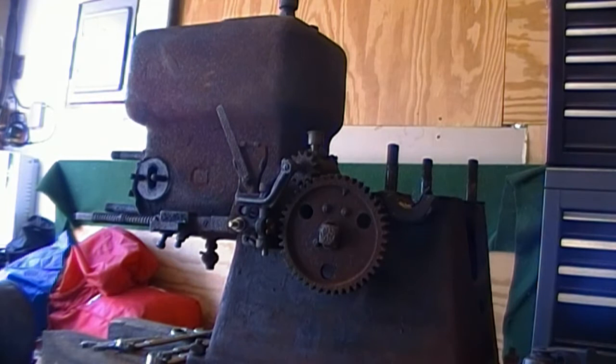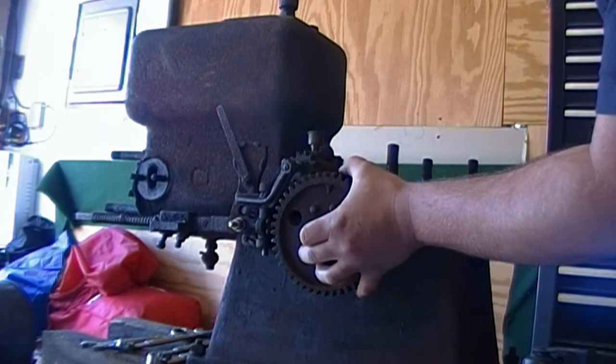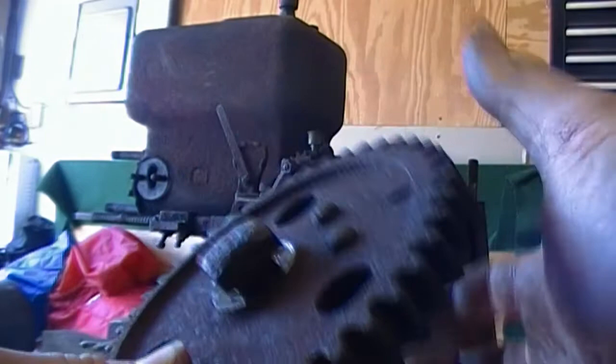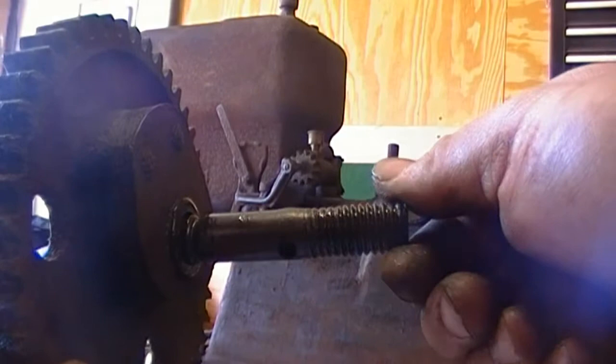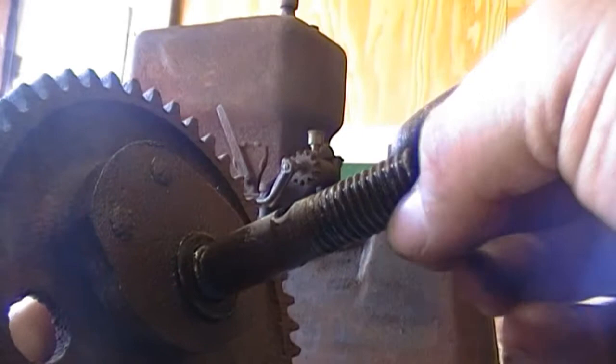so we'll pull the cam gear out real quick. That's not even really held in there. It's easy as that. I don't think having this big square head bolt is original. Everything that I've worked on has had a pin, and you put a cotter pin out in the front of the gear holding it onto the shaft. It just doesn't seem right. I think it's homemade. There is a lot of play. So I'm about to have that bore out and sleeved and a new pin made. That'll be easy enough to do.